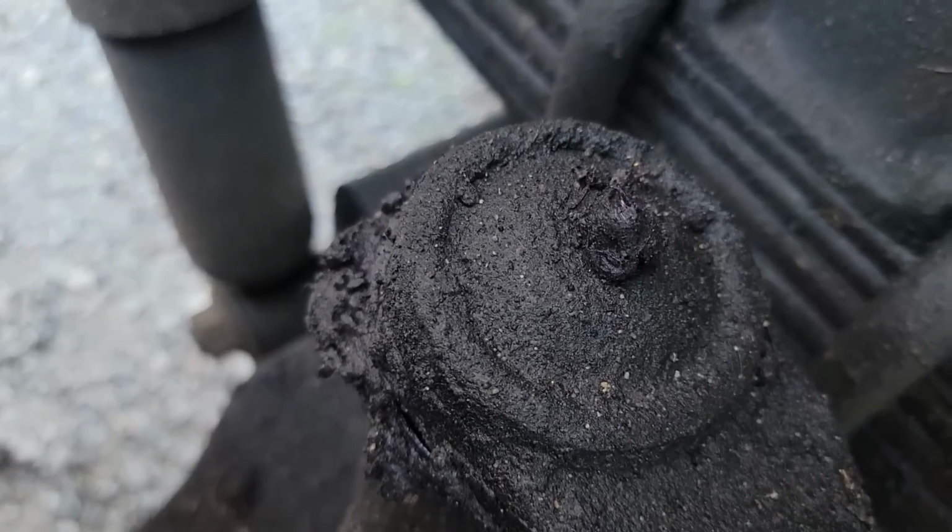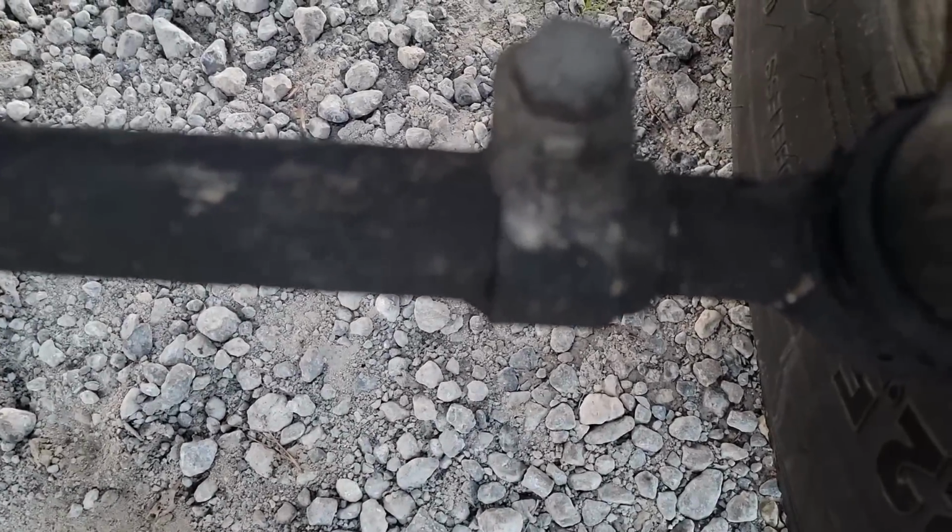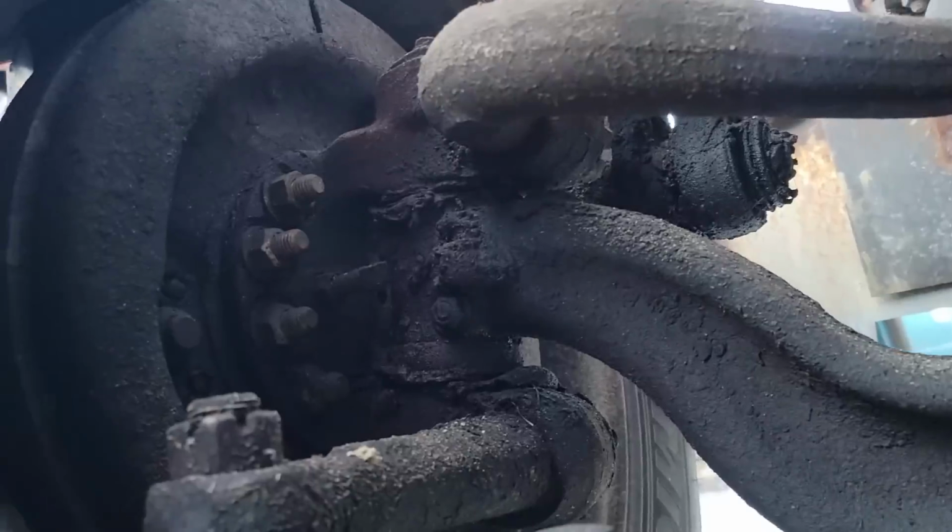That one's tight. This one's loose. Not horrible, but enough to notice. That one's tight. I need you to turn that wheel a little bit, left and right, I gotta check the other side. Go ahead. Not so much. Back and forth faster in smaller amounts. Less, less, and quicker. That's tight too. Okay. Alright, we'll check the kingpins now. Okay, go ahead.